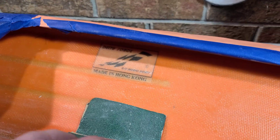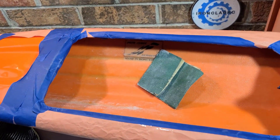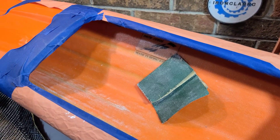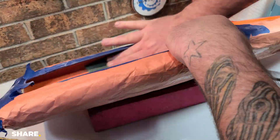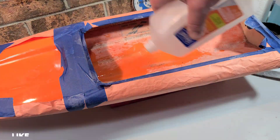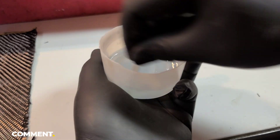Let's go ahead and sand and rough up the interior of the boat. Round off any hard edges, hit the whole boat with 80 grit, hit the transom too. Once it's all roughed up, preparation is the most important part. Hit it with some alcohol or denatured alcohol — I use 91%, it works fine. I'm going to start with about 60 grams of resin, which should wet out the whole boat with about 20 to 30 grams left over to lay on the mat.